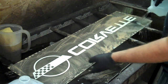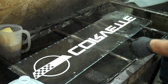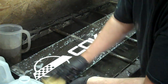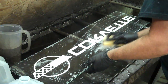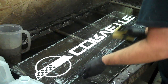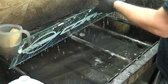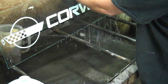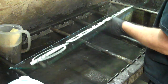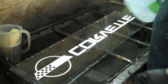Now I'm going to clean it off with some tap water and then wash it up with soap and water. Any time you're working with glass and going to mirror it, you can clean with tap water for rinsing — ordinary tap water — so you're not wasting your distilled water. Then I follow it up with distilled water, which takes all the minerals off the surface and cleans up the glass really well.